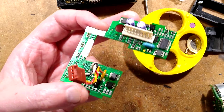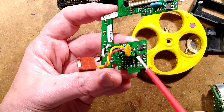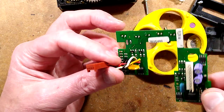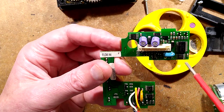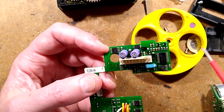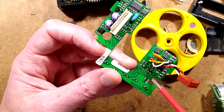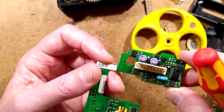Before I put this back together, let's take a look at the circuitry. On the output we have what appears to be a dual MOSFET pair, possibly providing an H-bridge to drive the motor in both directions. There are current sensing resistors here to detect when the motor has stalled. There is a PTC thermistor fuse for overcurrent protection. On the control side over here we have a little 5 volt regulator, and down here we have a PIC microcontroller - because CC Talk isn't a terribly processor-demanding protocol, it can be done with a simple microcontroller with some serial memory attached to it. It's a very minimalist circuit board, also with options for solder links.